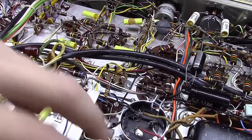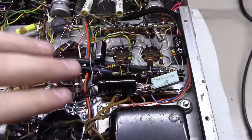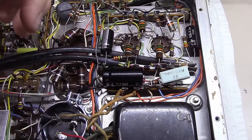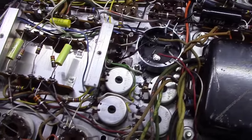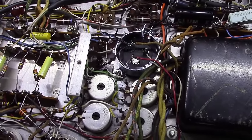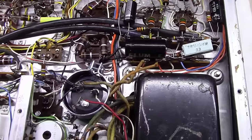So I'm going to want to make sure I get the right voltages, or, you know, the negative 48 volts here. Let's say it was at 52 volts or something. Then I'll probably have to increase a resistor somewhere along the way here to help offset a little bit and get these voltages in range. Otherwise, you're driving the negative bias on these output tubes too much on the grid, and can cause the tube to overconduct there, or be too hot. So we're gonna check all that out as I bring it up slowly.